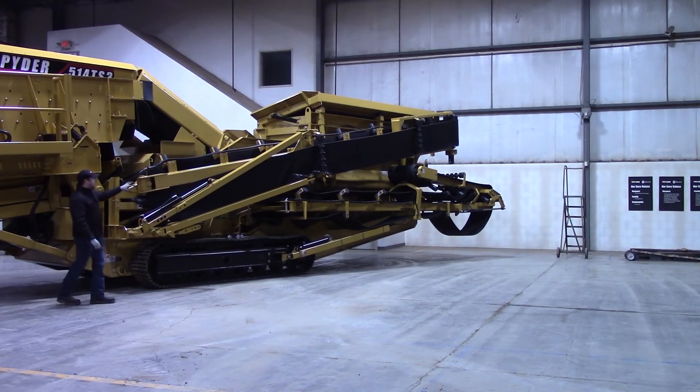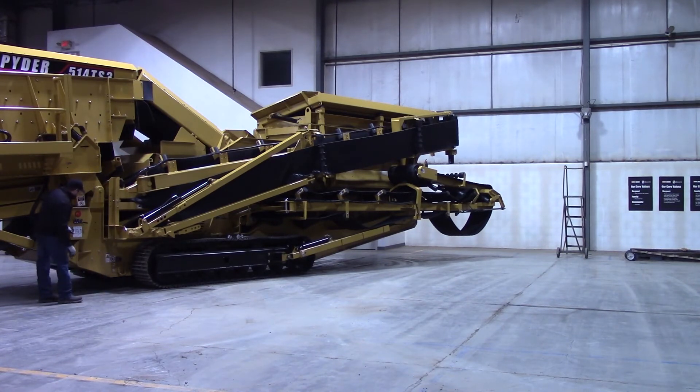Now that we've got all those unpinned, we're ready to start swiveling it out. You're just going to follow your directions on the diagram to unfold — pull this far handle up, push this handle down, and start unfolding it. We've already got the engine on; obviously we need the engine running, just at low idle. Don't need any more than that. Make sure it's not in move mode or anything like that.